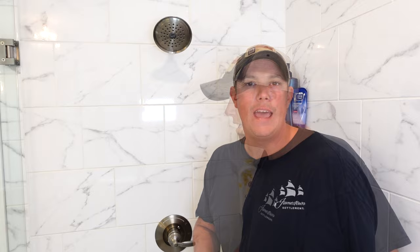What my issue is, is more likely the handle — the valve that turns the water on and off is likely my issue. It's probably not closing all the way. Maybe there's a seal or a gasket in there that's gone bad that's allowing just a little bit of water through. So that's where we're going to start. We're going to go ahead and take this handle off, get to that cartridge on the inside, see what the problem is, and then what I'm going to end up doing is just replacing the entire cartridge on the inside.